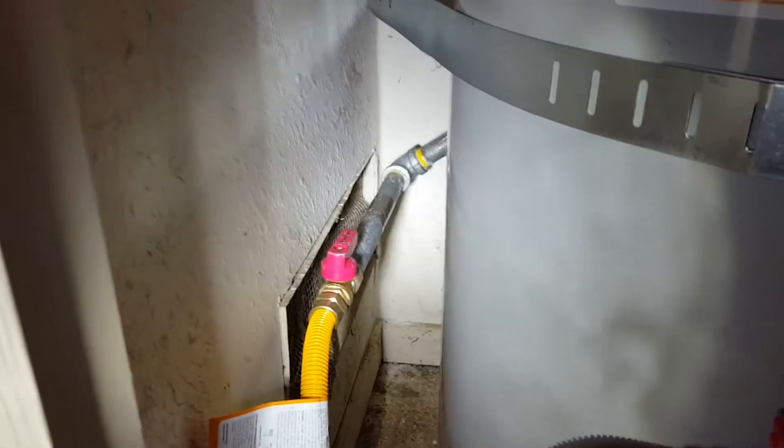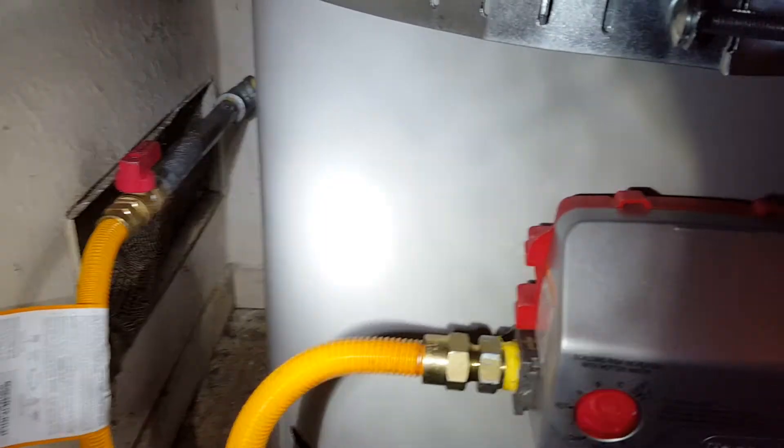It's a little more accessible now. We put a brand new gas supply line over to the controller — that was not in the scope of work, the valve and the supply line, but we like to see things new, so we went ahead and replaced it anyway. We also put in the adjustable seismic straps at the bottom third.